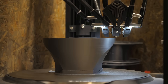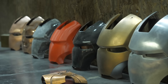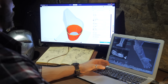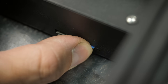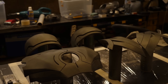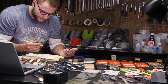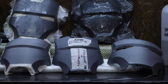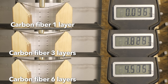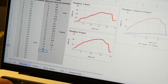Printing large but thin parts requires increased demands on hardware and print settings, but ultimately, after composite reinforcement, we receive parts of completely different quality. Your investment in learning and practicing 3D printing is definitely worth it. In the meantime, our printers are loaded a whole month ahead, so there is time for science and research. Composite reinforcement and clear coating of parts are very labor-intensive tasks — it took me several months just to build a helmet and torso. The best thing we can do before working with printed parts is to run several test samples, experimenting with fiberglass, carbon fiber, and Kevlar in different combinations. We enter the strength test data into a table to determine the appropriate composition for different parts.